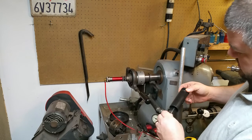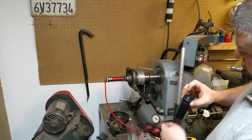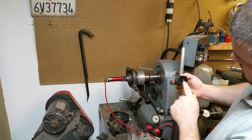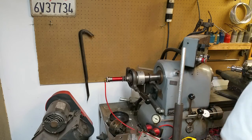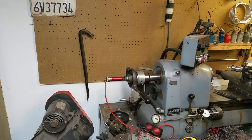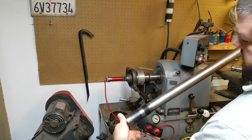I did a couple of tricky things here. This piston is convex and has a taper machined into it. It's got a quad seal, a little bleeder port, and a set screw. I added a little spring inside with another piston down inside — the intent is that this feeder actually screws into the back of a 16C collet. So you stick it through the draw tube on the Hardinge CHNC1 and screw it into the back of the 16C collet.